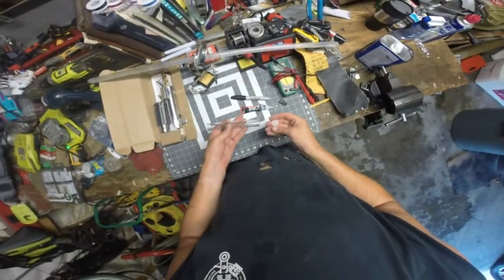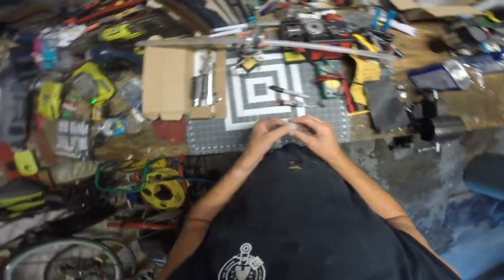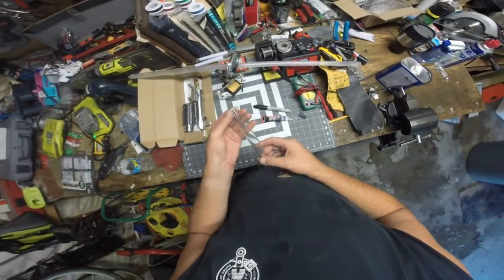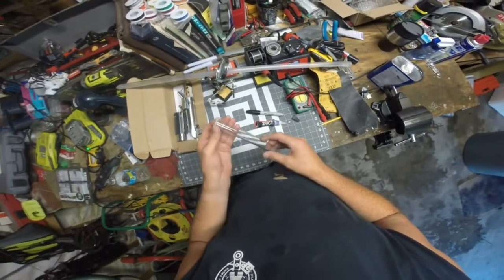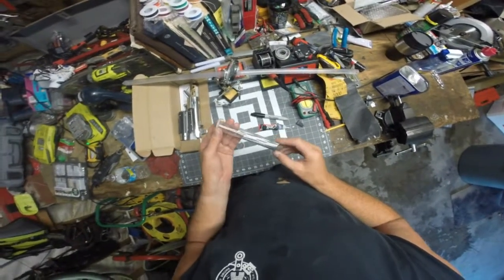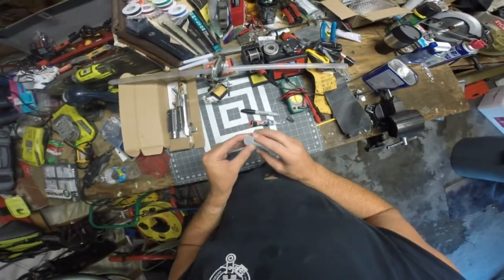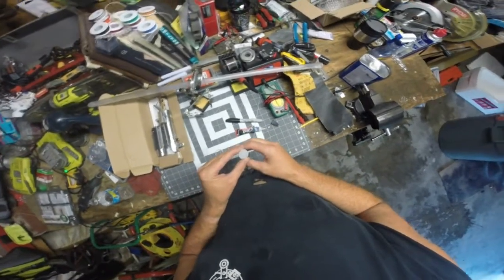So while I was sitting here, I told you can use these leftover scraps for blade plugs, and indeed you can. I'm sitting here drinking a bottle of water, and I noticed that the water cap was about the same diameter as the TCSS 7/8 material. Because the custom Saber Shop doesn't have their 7/8 blade plugs in stock right now, I think just temporarily I'm going to make my own. I'm going to cut this at 1 1/4 inches, glue this on, paint this black, and then put a brass something on there, some kind of greebly.